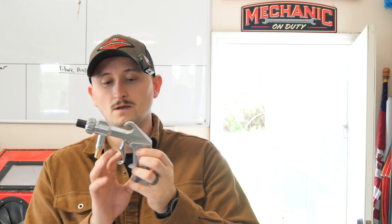So I had another issue I was dealing with when sandblasting — my gun is pushing out a lot of air through the trigger, so it's not sealing. A lot of my compressor power is being pushed out through the trigger piece. So I did pick up another gun, and hopefully this one seals better. I'm going to take out the old gun, change out the fittings, make sure everything's going to work, then throw on a ceramic tip, and let's hope we have better blasting power.